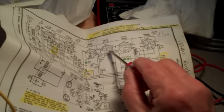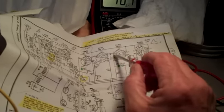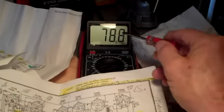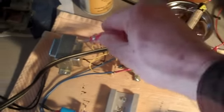Now, of course, there's a trade-off here — there will be a little bit of distortion on the positive cycles of the audio. If you want to know how all that works, look up grid-leak resistance. So our power supply is operational. However, the output voltage is down to 78 volts — I don't like that. I'm going to have to change transformers; this one is too weak. So I'm going to buy a second one like this, take this one out, and put one like this here — I'll have two of these. That'll be done in the next video, and we'll see what our voltage is. I want up around the 90-volt range, and if the voltage is good, we'll tear this whole thing down and put it in a gray box.